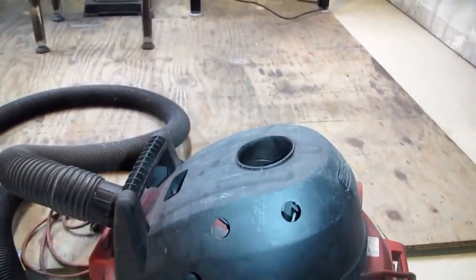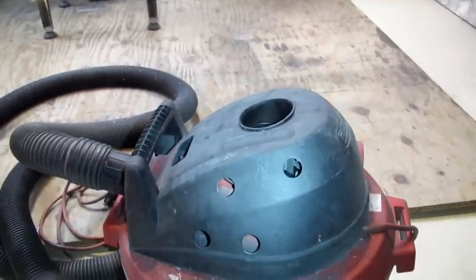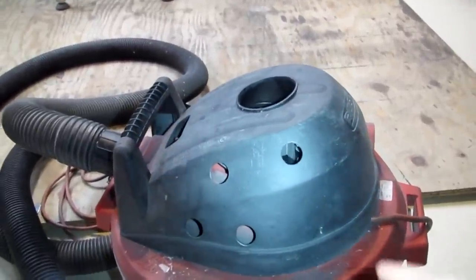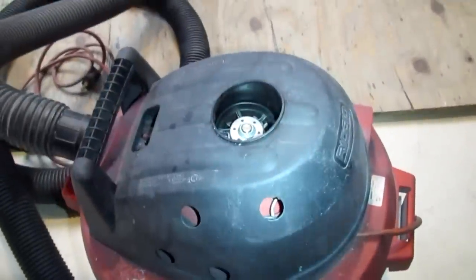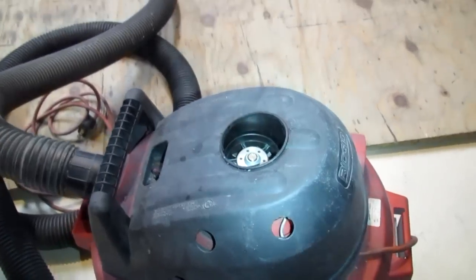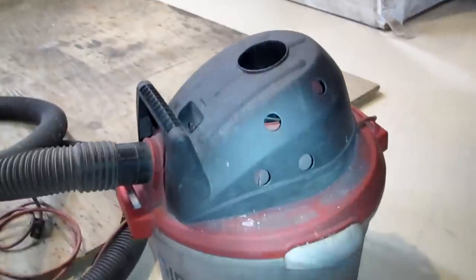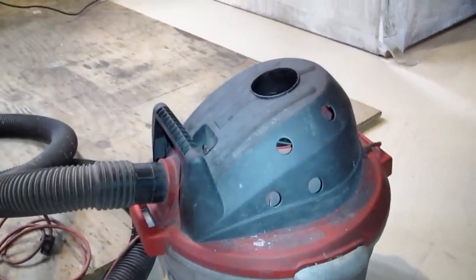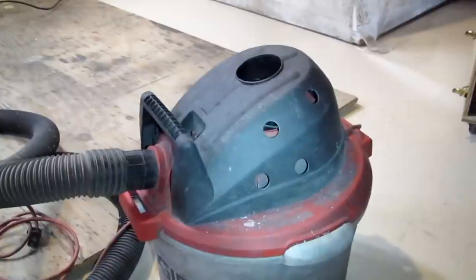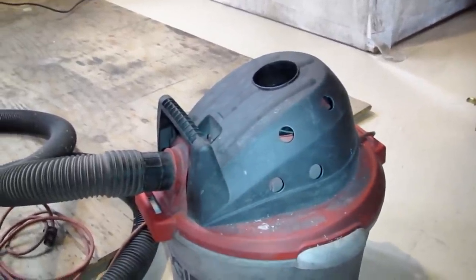To make it work inside the cabinet, where it can get kind of warm, I've added some extra holes in the housing, and I've also removed the grate over the exhaust hole on top of the motor to improve the airflow. The reason you have to do this is because if the vacuum filter gets clogged with dirt and dust, the vacuum isn't bringing much fresh air into the inside of the cabinet, and so the heat from the motor starts to build up.